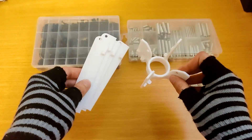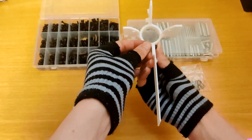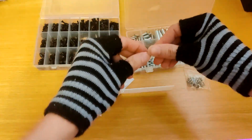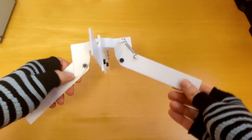To assemble the mechanism, I'll use these machine screws as a hinge around which the fin can rotate, and then I'll install a small extension spring into the middle, and it makes the fins deploy.